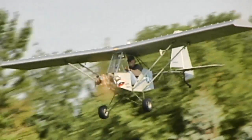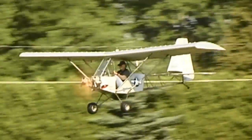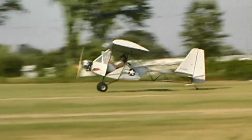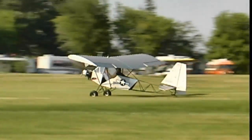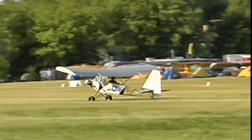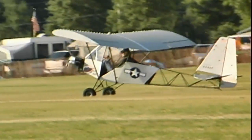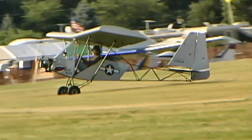And there's also a terrific amount of blow-by crankcase pressure with a cut case. And this one here has very, very little blow-by. It's hardly any because the volume of the case is so big compared to the pistons that come together at the same time to create that pressure. And it's really a nice answer to the half VW. That's why I call it the better half. So it's a better half with a full case.